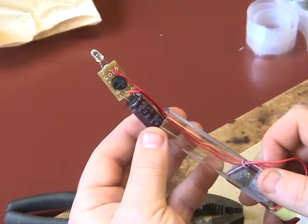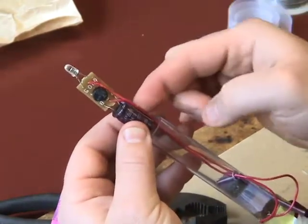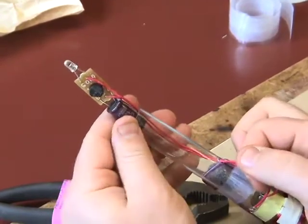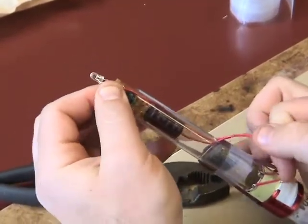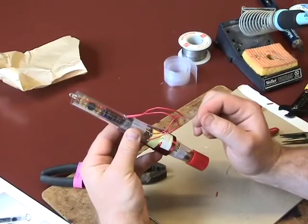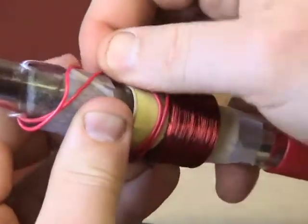We are now ready for step 15. Place the printed circuit board inside the clear plastic tube with the capacitor going in first. Place the red wires flat against the capacitor so they will not jam while sliding the assembly into the tube. Use the red wires to help pull the printed circuit board into the tube — go slow and work the capacitor and circuit board all the way in against the plastic straw and sponge bumper. Once the circuit board assembly is all the way in, wrap the excess red wire around the tube and place it flat against it.